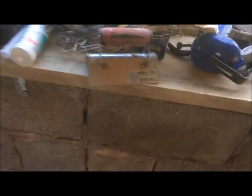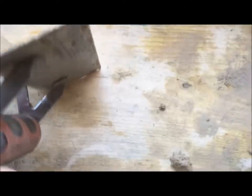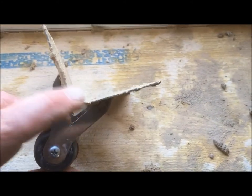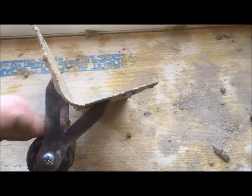We'll go over here now. Here's the one I prepared earlier. Pick up our corner trowel. It's worth noting you can get these with different radiuses. This one has got quite a small radius, which is basically how rounded it is. If it's a small radius you won't get much of a curve, and if it's a larger radius you get a bigger curve. I probably would have gone for a bit of a bigger radius one, so it's something to watch out for.